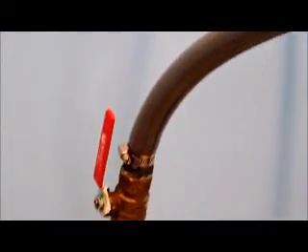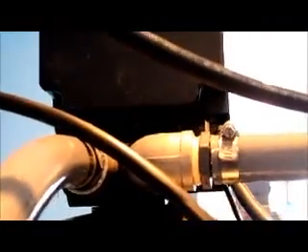We're going over the flow of the system. The city water pressure comes in through this valve here, travels up this pipe and into the back of the aggregate filter. The aggregate filter is like a sand filter and it never has to be replaced. It will filter down to about 20 microns. The water enters this tank, flows down from the top through the media, and at the bottom there is a screen where the water goes up the screen, up the pipe, and then over into the next filter.